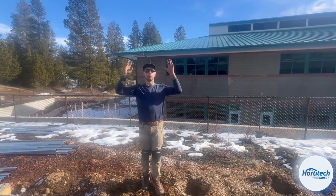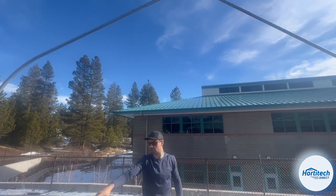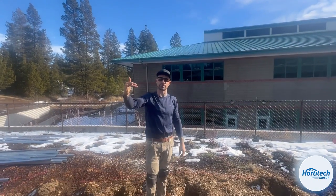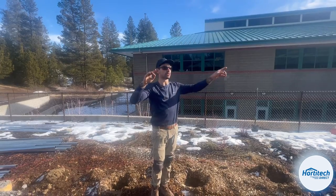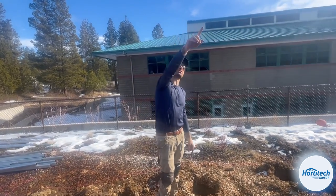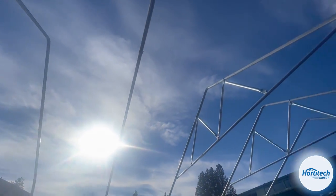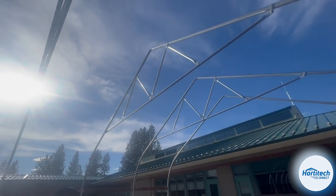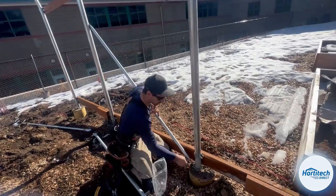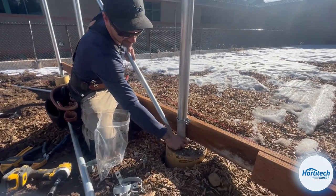and then once all that's done, we'll be able to work from a fixed plane, run our purlins, which are gonna be the same material that hold the bows at even spacing. Pretty similar to what the wood runs are doing on the side, it's gonna go on the ridge of the structure and mid-center. So we're gonna work simultaneously as we begin this and get everything attached. Yep, 2 3/8 brace band.